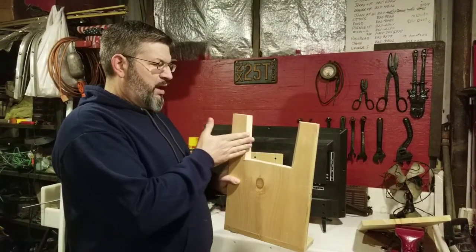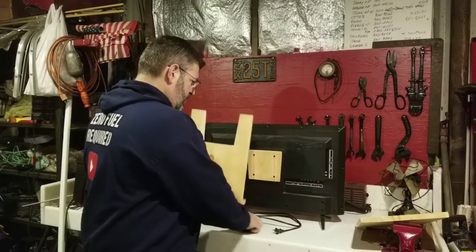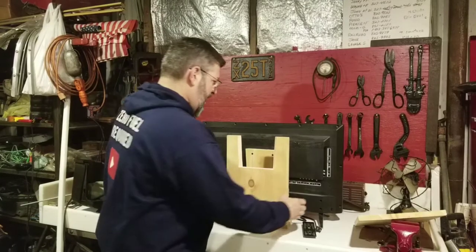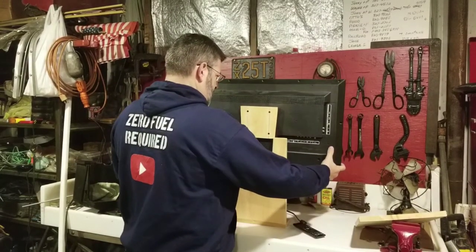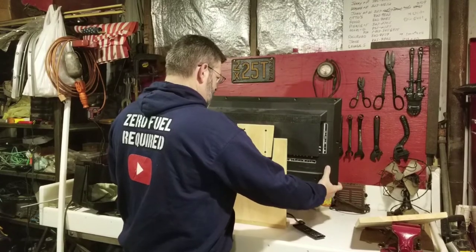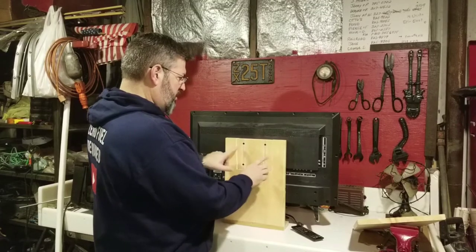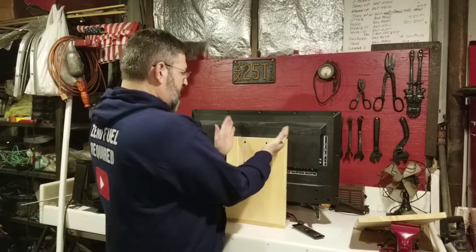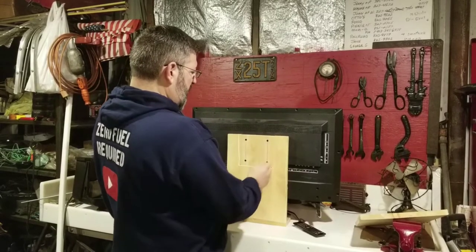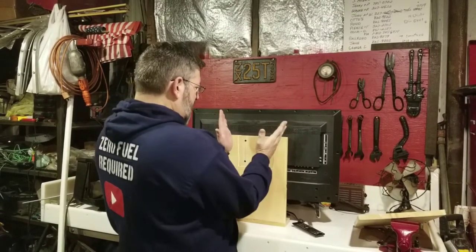With this mount, the reason it's cut this way is when it faces the TV you want it angled — either a 30-degree or 45-degree angle — so when it actually goes in place it slides down into the groove and leans against that angle. On top of that, it's actually tapered about a quarter inch inward from one side to the other, so it's shaped to drop right in easily.